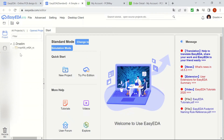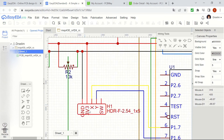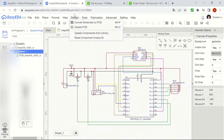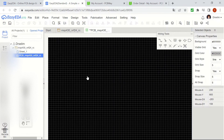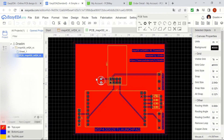First, I drew the schematics and made the connections between the components. Here I used built-in components and I also created my own symbols and footprints, such as the MSP430G2ET launch pad, to be used in the schematics and later in the PCB design. After using the Convert Schematic to PCB option, I set the places for the footprints and used AutoRoute for creating the traces. Then I optimized those connections in order to minimize vias and also tried to design it in a way that I could do the soldering easier.